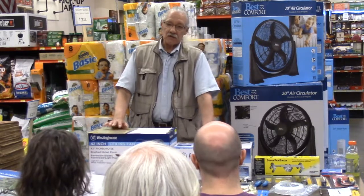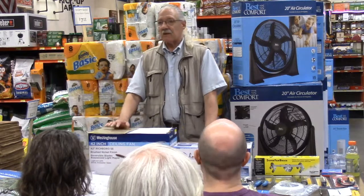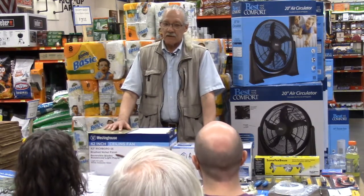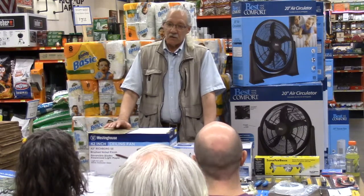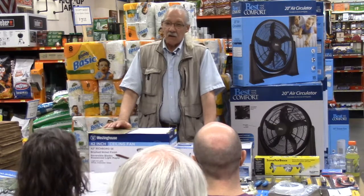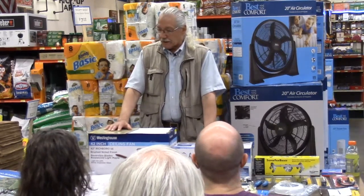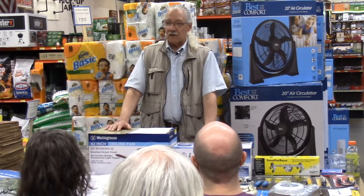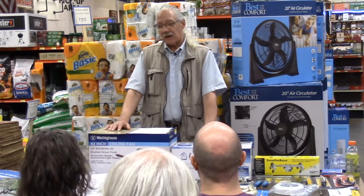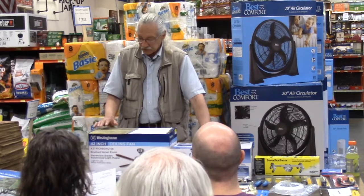A lot of the smart switch stuff now, you have to be careful, because they're intelligent switches and they have to be on all the time. They require a neutral in them. So, in fact, the National Electric Code now says that all switching where you're running new wiring, those switch boxes will have a neutral wire pulled into them. Whether they're used or not is another story. But it's a change because of all this new smart switching going on.